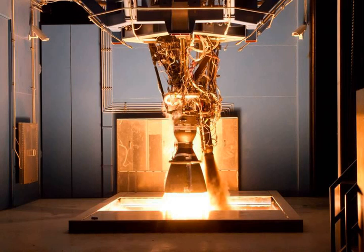The design goals for the new engine included increased reliability, increased fatigue life, increased chamber and nozzle thermal margins, improved performance with a thrust design objective of 140,000 lbf and 70–100% throttle capability, and improved manufacturability with lower parts count and fewer labor hours. When engine testing was completed in June 2012, SpaceX stated the engine had completed a full mission duration test firing of 185 seconds delivering 650 kN (147,000 lbf) of thrust, also confirming the expected thrust-to-weight ratio exceeded 150.